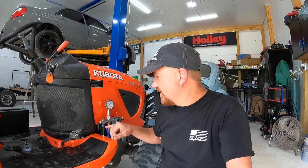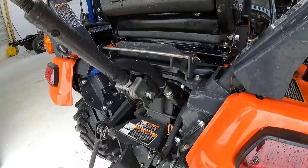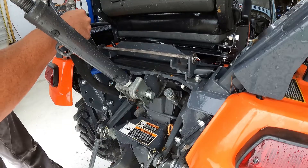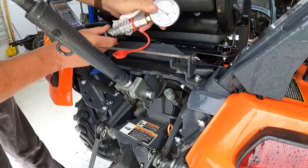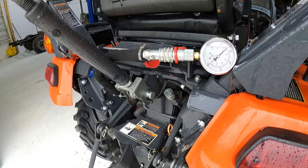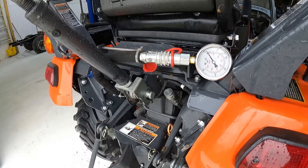You can also test pressure on your backhoe feed lines — disconnect this hose right here and hook your flat-face connector into that hose to check pressures. This one is not controlled by a lever when it's on bypass mode like this, when it's not hooked up to the backhoe. Start the tractor, hit your target RPMs, and that's when you'll get your reading. When you shut the tractor off the pressure will relieve itself. This tells me the pressure relief valve also controls pressure for backhoe movements.